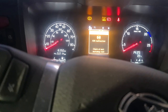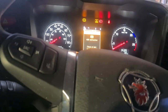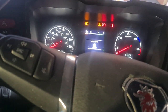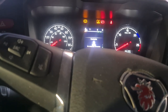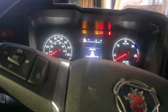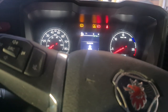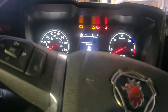Just in case you don't know the wheel numbering: nearside first axle is wheel 1, offside first axle is wheel 2, then number 3 and 4 on the second axle. Third axle nearside is number 5, offside is number 6. Fourth axle nearside is number 7, and offside fourth axle is number 8. So our ABS sensor fault on wheel 8 means the offside fourth axle is playing up.